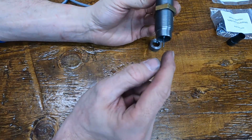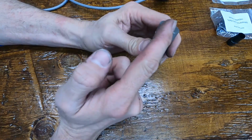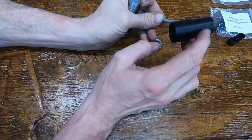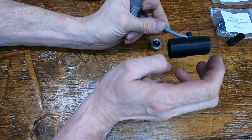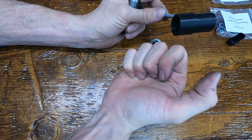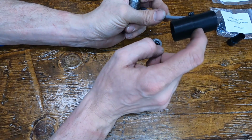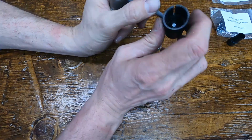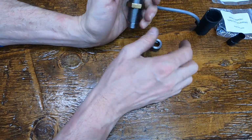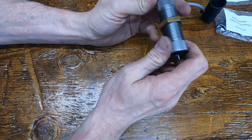that limit switch. So if you do get some debris or a Berdan primed case, it will push this up and activate that limit switch there. And on my machine, you want to hook this up on the Mark 7 to the remote stop switch. So with the Mark 7, you can get a little remote stop that, if something happens, you hold the remote in your hand and it's just got a thumb button. You put this where that one gets plugged into, and if something happens, that little switch gets activated and it'll turn your machine off, letting you know that you have a Berdan primed case or some debris or something in there.